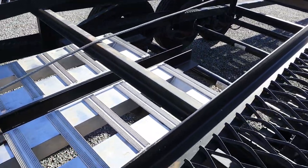Another piece of equipment you really want to invest in is a set of aluminum ramps. If you've never dealt with steel ramps, those things are super heavy and it's not going to be fun taking them on and off the trailer three, four, or five times a day. Aluminum ramps are expensive up front but they last a long time, and if you take care of them, they will save your back. Make sure you get some with a flat hook and a knife edge — that levels everything out, keeps the ramps from bending and curling at the end, and helps stabilize the ramp on the trailer to prevent it from popping off, especially when you're not loading on level ground.